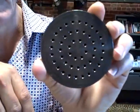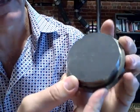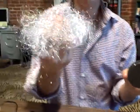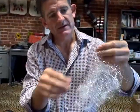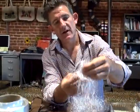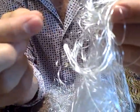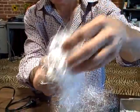They force it through a nozzle that looks like this and you can see all these holes. This is the entrance side of the nozzle. On the other side are such small holes you can't even see them, and out of those holes come angel hair filament of polyester. This filament is what we're going to use to make yarn. We take this filament and draw it down into very, very thin little hairs — clear hairs of fiber — and then we spin them together into very soft thread. These threads actually have many fibers spun together inside of them.